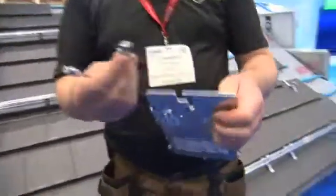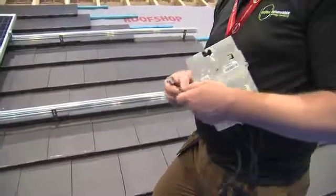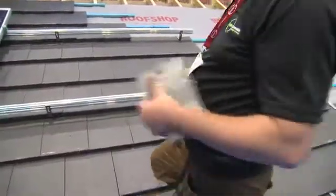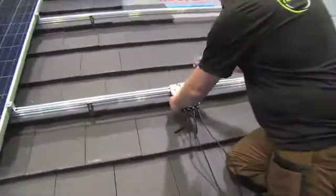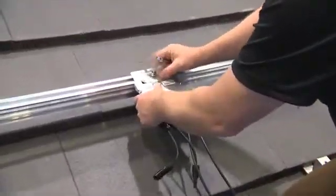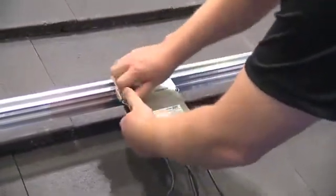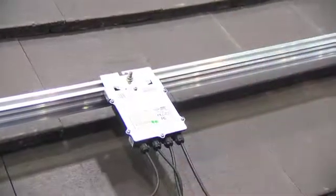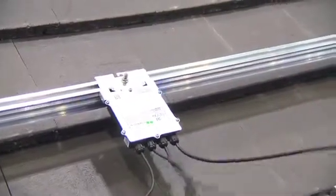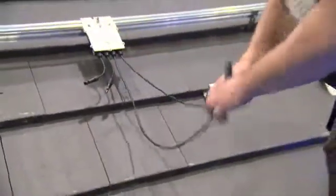The simple hammerhead bolt attaches to the rail in the same way that the rail attaches to its roof hooks. We put the optimizer on the top rail — mounting is as simple as that. We would mount all of the optimizers in the locations behind each panel and then connect them in series, and the panel itself connects into the optimizer.